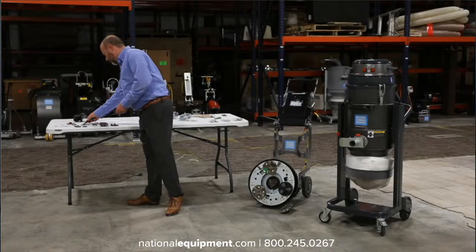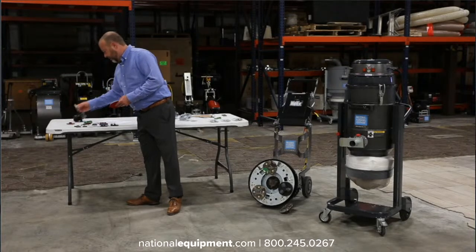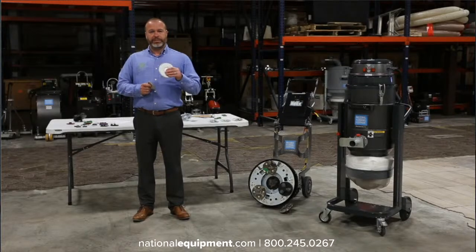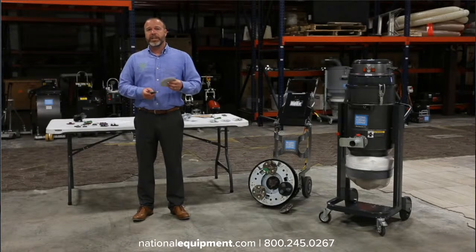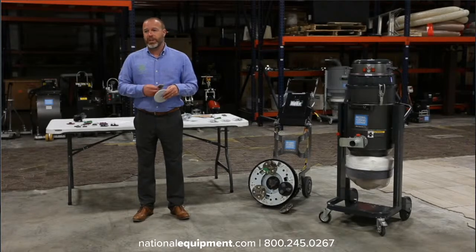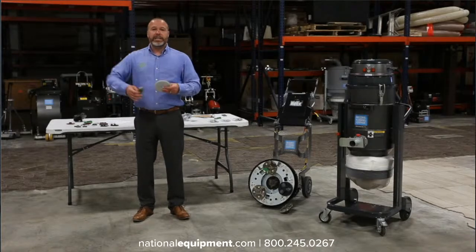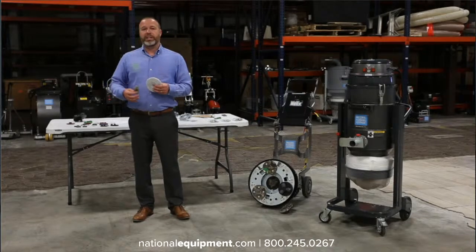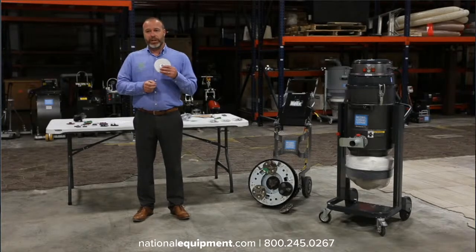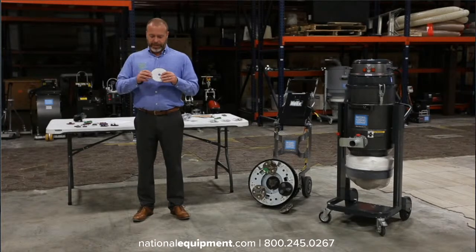We've got another tool we haven't talked about yet, and it's kind of the most expensive per square foot and the most aggressive tooling we have. But if you've got a job where they needed it done yesterday because, let's say, the surface prep contractor they had hired flaked out, now the job's behind schedule, or the whole thing is waiting on this one part to be done, brazed diamonds are a great way to surface prep and remove coatings from the floor.